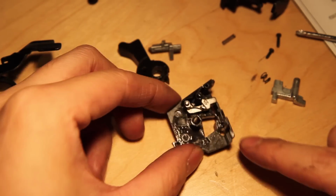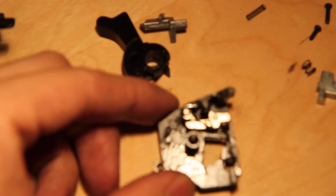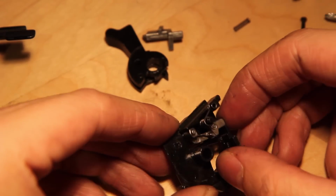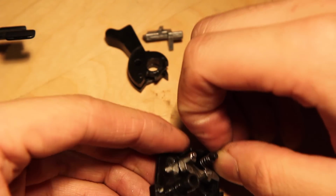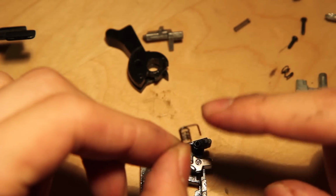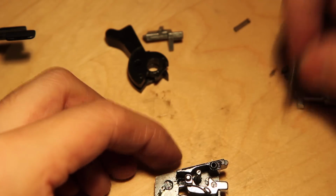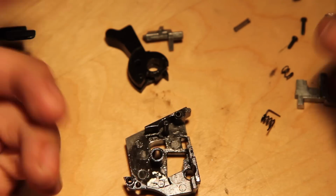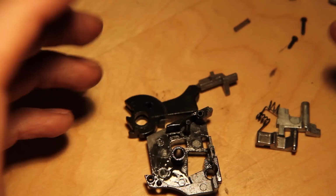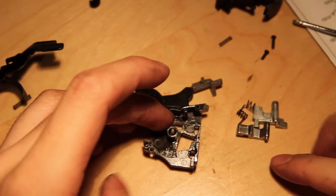Okay. Now how you disassemble the rest. Okay, you can actually just slip out the rest. If I were you, start with the spring to relieve the tension. Okay, grab this top part. You can probably grab it with your own hands. Just slip it off. Make sure you don't lose this, and then that's your valve knocker. Okay, so these are all the parts related to the hammer. Okay, and now I'm going to teach you how to reassemble the hammer.